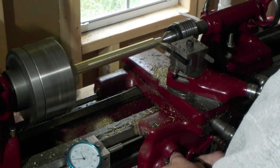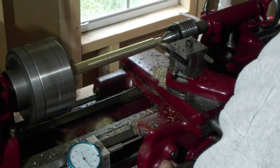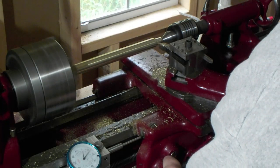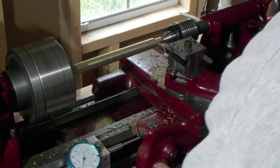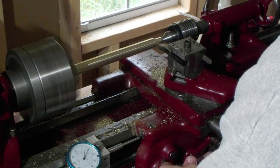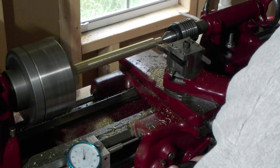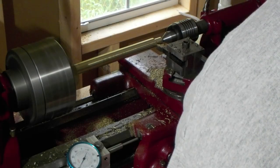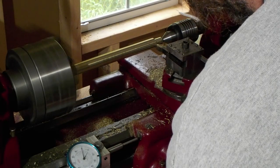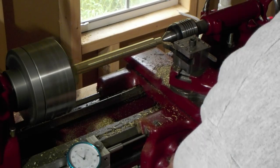Should have said at the beginning, you're using 12 inch long round stock. The hammer handle is going to be about 7.5 inches. The hammer head is 3 inches. Really, those numbers you play around with. Make a little longer handle if you want. You probably want a longer handle, to be honest. But it's a good little tack hammer. I use it mostly for assembling parts. It's good for handing out to friends and neighbors too. Simple project you can knock out in two to three hours.